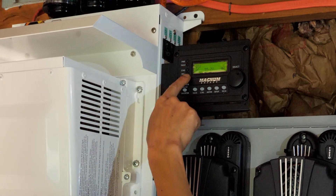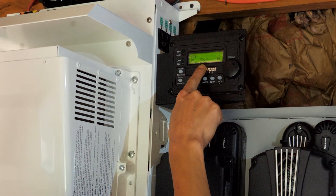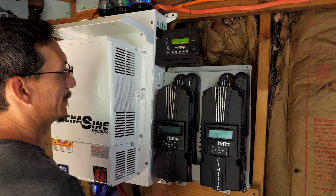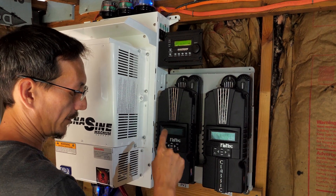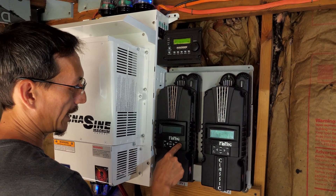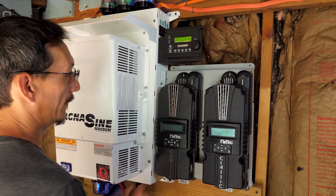Inverter is off. DC voltage is 55.2. I have noticed that this measures about a volt higher than it actually is, so I always go by an actual meter reading of my batteries. The charge controllers allow you to offset the voltage that it's reporting so that it's reporting properly. So if your charge controller is about a volt too high, you can tweak it and set it down to match an actual meter reading that you've taken on your batteries. I love that about that.